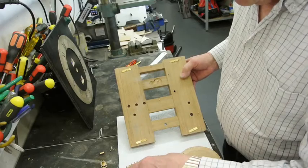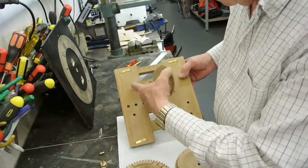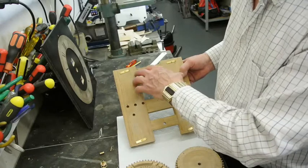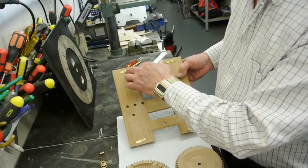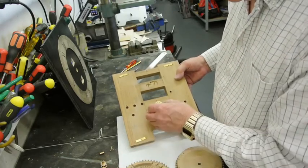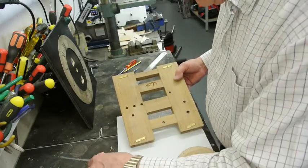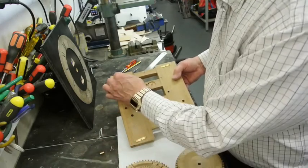And then the next wheel goes in there, and that's its arc going around there. I haven't got the other wheel with me, but it's just over there drying off with some glue on it, which goes in there. And the final one with the fly on it, the warning wheel, goes up at the top. And this pinion goes here, this pinion goes here, this one goes here, and that one goes at the top.